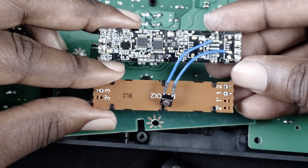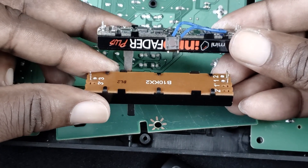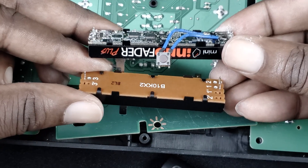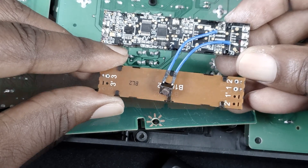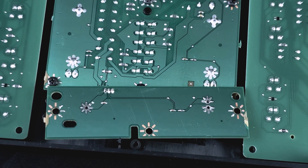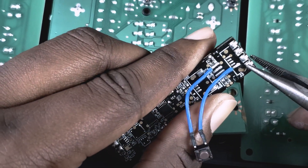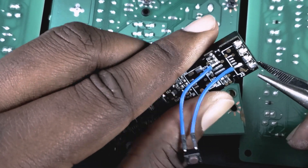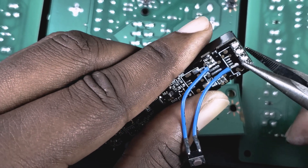In this scene, the original crossfader is at the bottom and the InnoFader is at the top. The idea is that you'll need to bend the pins or cut them — I'd probably recommend bending them down to match the original crossfader. The top left one needs to remain up and the top two on the right side need to remain up, so the ones in the red circle need to be either cut or bent down. Go ahead and grab your needle nose pliers and start bending those pins down. Take your time, gently apply a little pressure and bend them away from the center of the crossfader — this will prevent them from touching any other parts of the board unnecessarily.